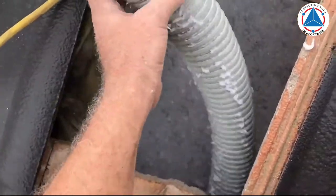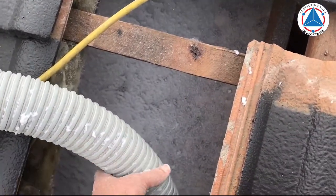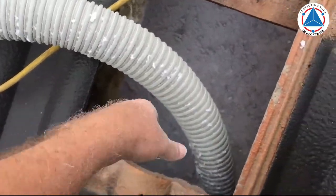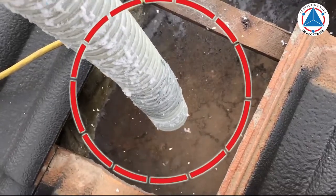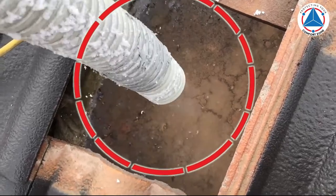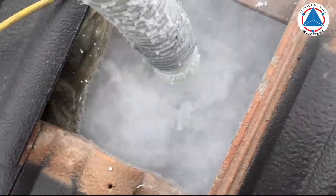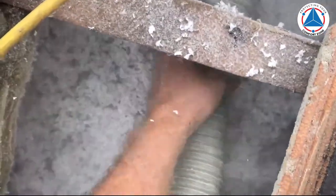The hopper has actually run out of material there because my offsider is just getting out to go down and fill it up. You can see there's no material on it — that's what it looks like. People think it flows everywhere, but it's only pumping into your roof because it's under pressure. Look at how quickly that fills that bit up. Four inches, or 100mm, is all we're trying to get into the roof.